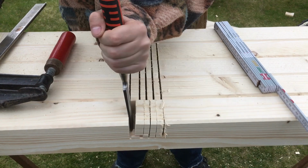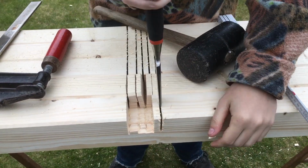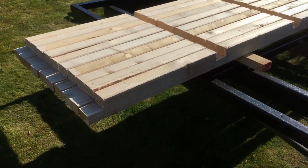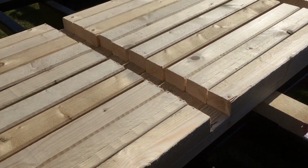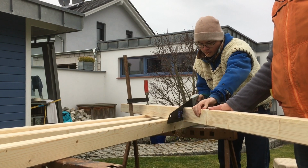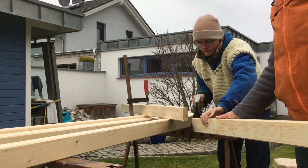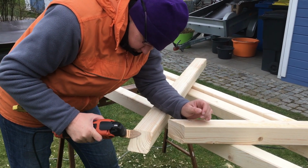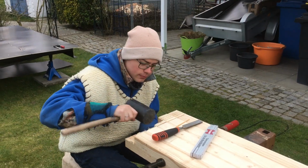While preparing the lengthwise beams, we figured out that cutting more often with the saw leaves us with far more accurate and clean notches after chiseling out the wood compared to blowing out just one big chunk. For both aesthetic and technical reasons, I decided the house should have missing corners in the front, which you can see is prepared here. This will be more evident later on.